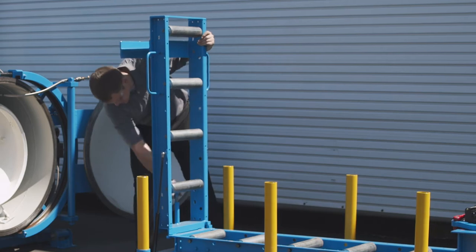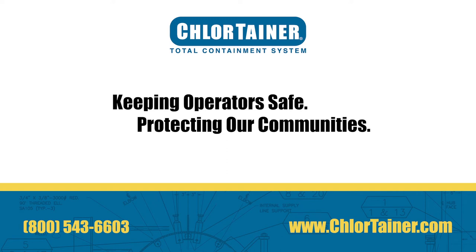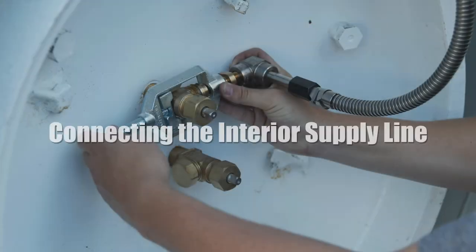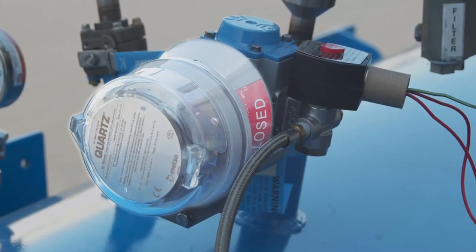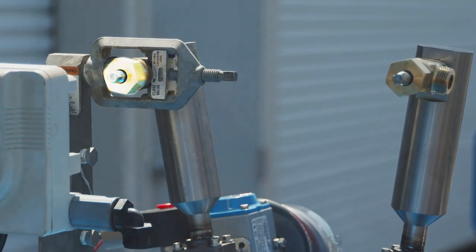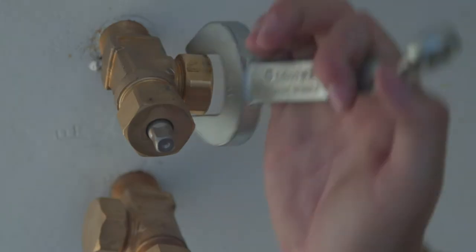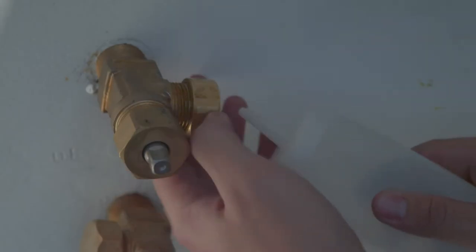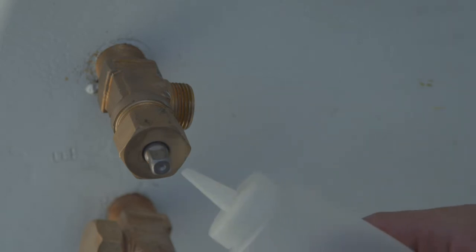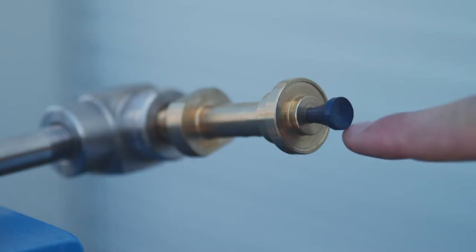Now we are ready to connect the interior supply line. The first step is to make sure both the exterior chlorine supply valve and the ball valve are in the closed position. While holding an ammonia wick next to the top of the interior gas supply valve, remove the cap from the cylinder's valve using a chlorine valve wrench. Be careful to not remove the cap from the bottom of the interior liquid supply valve. Examine the faces of the interior gas supply valve and the yoke adapter to ensure a clean connection.